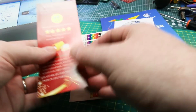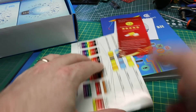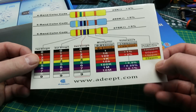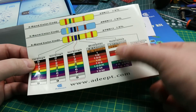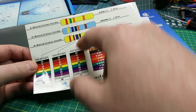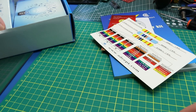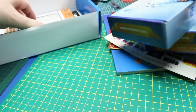There's a CD included — 'ultimate starter kit.' We've got a 'dear customer' feedback card asking for five stars. There's also an actual sticker for resistor color codes, which I like. They're transitioning to teaching people electronics and not just the Arduino stuff — pretty cool. For anybody not familiar, the color bands on resistors denote the numerical value: first, second, third digit, a multiplier, a tolerance, and a temperature coefficient.